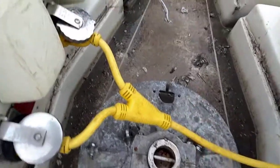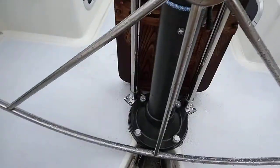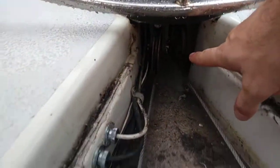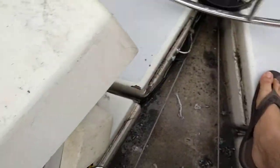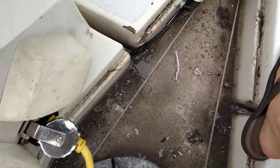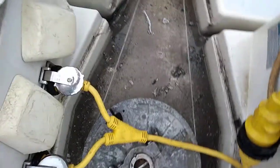Once you can remove the bull gear, you can isolate the noise. The three places you might find noise are: directly under here at the sheaves, directly here at the bull gear, and also in the pedestal area. I haven't really played with mine with the top off too much, so I don't know how much play or noise there really is.